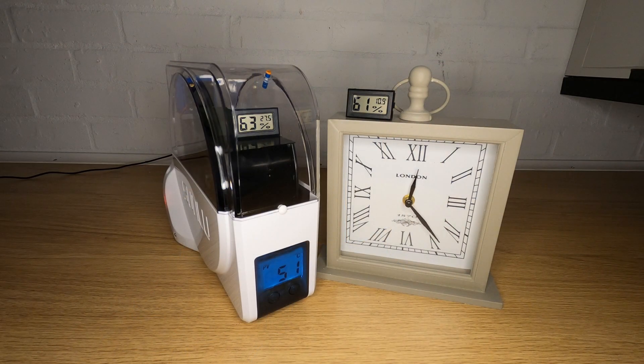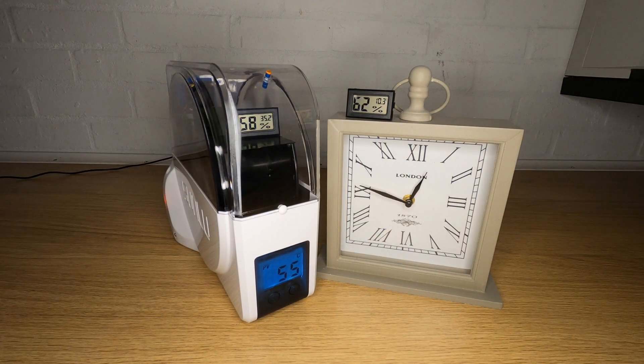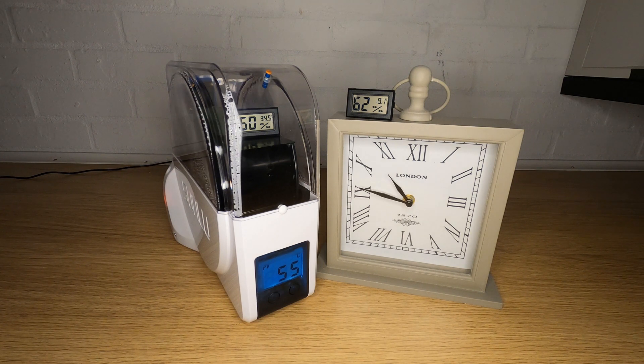That's pretty good and it's going to be tough to beat. First I tried testing the side intake vent — not surprisingly with the fan on full speed and more air coming in, the heating element that already struggled to stay above 45 degrees didn't cope well and I definitely had too much airflow. So I brought in the timer with the fan on for only 20 seconds every 30 minutes. This gave us plenty of heat and every 30 minutes there was a reduction in humidity, but there wasn't nearly enough airflow to clear the damp air and condensation kept building up quicker than the fan could clear it.